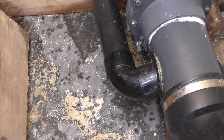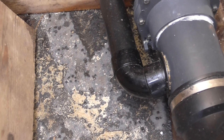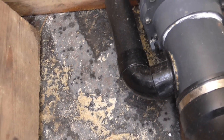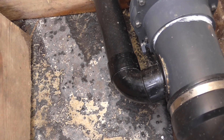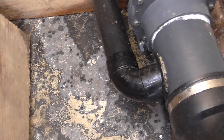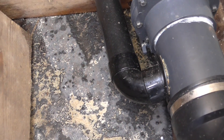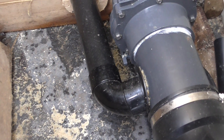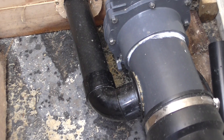Just get the right size for the pipe and all you have to do is push it in. When you push it in, you probably need a little bit of something to make it slide in, like Vaseline or something like that. To get it to slide through the hole, because it's usually quite tight - and that's what actually forms the seal and makes it that much better.